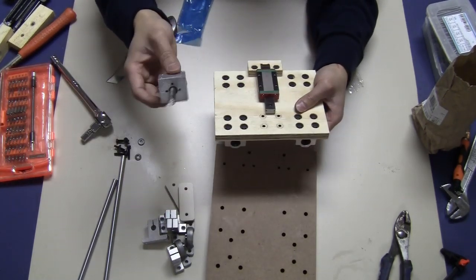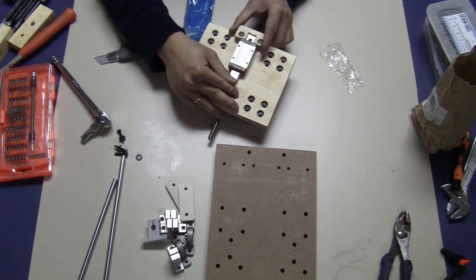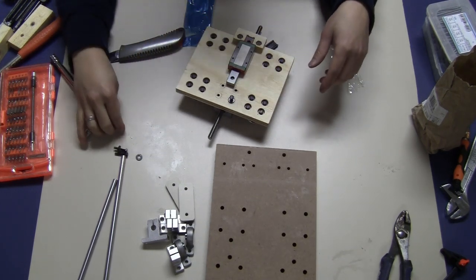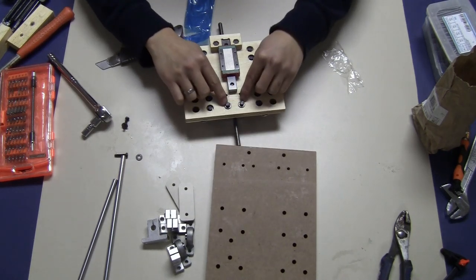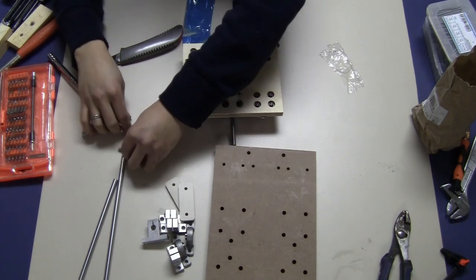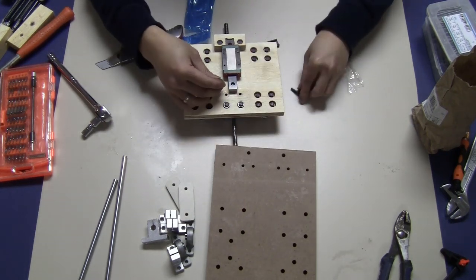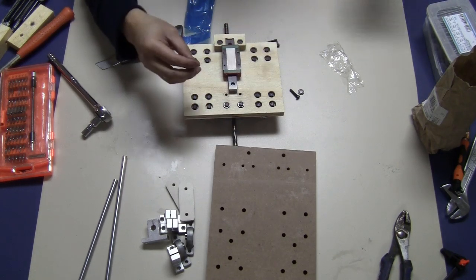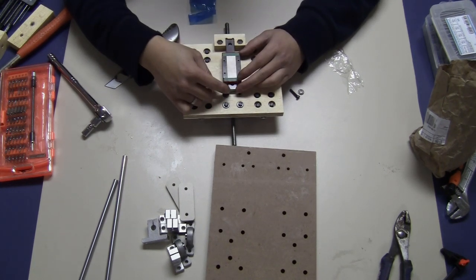Next step is to install the nut housing block on this. Be careful not to tip the bearing block — it will kind of slide out and all the steel balls inside will run all over the place. For these two bolts I only use one washer, but for the two really close to the rail I need to put more washers so the bolt is high enough to stop the bearing from sliding out. The bolt stops the bearing right at the edge of the rail, so this will be just perfect.